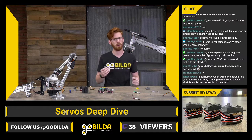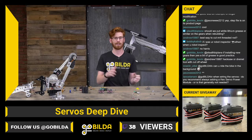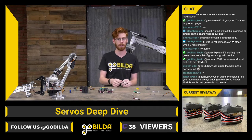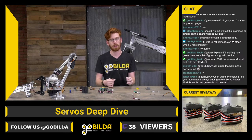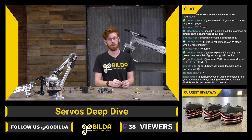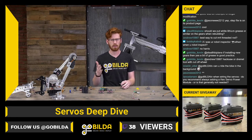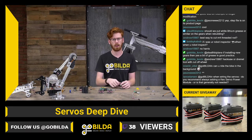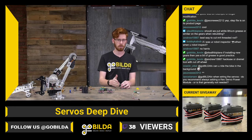If you've ever heard of the story of Ford Field in RR1, where Gluten-Free frantically tried to add a servo power module to Landgro's robot, that's a big reason, because it can increase reliability, not just the power of your servo. If you're running something that's going to be really high power, you can run into issues by running it directly off of the expansion hub. The other facet is that that's not legal. You couldn't legally run a D950 directly off an expansion hub because it would be rated to pull more power than the expansion hub could put out.